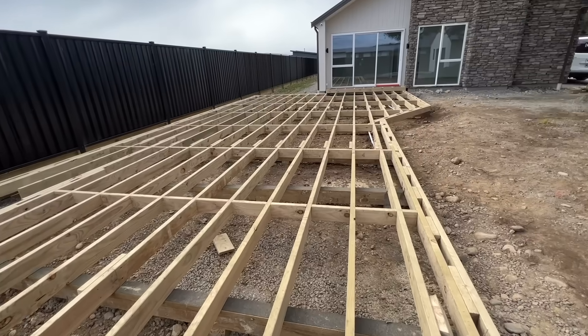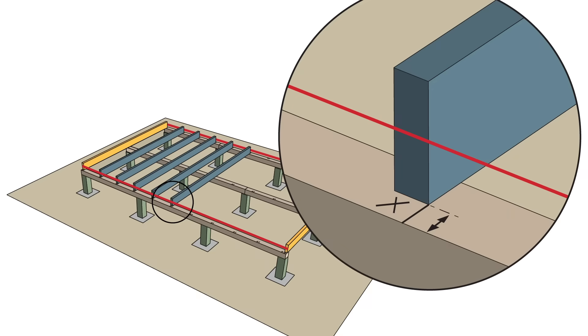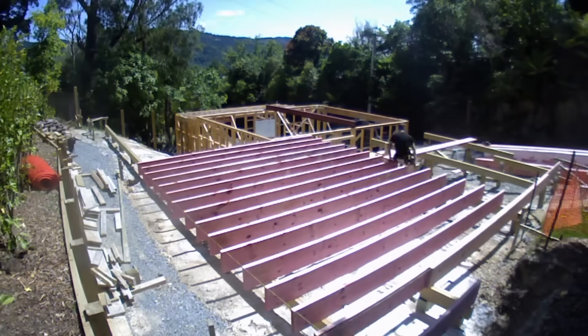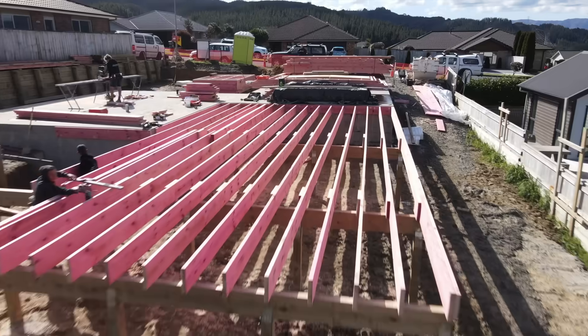When installing joists, mark out your joist spacing with a line and an X — the line means that's the edge of the board and X means that's where the board sits. Go to the other end of your structure, mark that out in pencil, and make sure the spacing is working. Once you've got the running measurement working at either end, use a chalk line to ping those lines on any intermediate bearers, so every joist sits straight and square — exactly what you need for that last layer to be perfect.